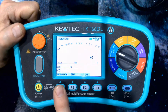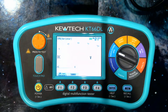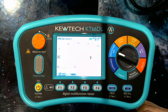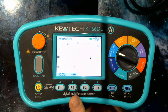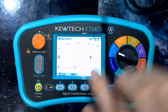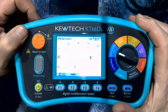On F1 we've also given you the option to test your surge protection device, checking that it dumps the voltage to earth at the specified level. It does a 1000V ramp test, steadily increasing until the voltage breaks down. It will display the DC voltage and the AC voltage — the AC voltage being the specification of the device you're testing.